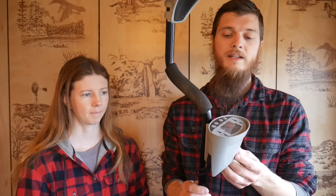We've been using it for a year now and it's been awesome. So our goal is to convert this to run off a Dewalt 20 volt battery. That would give us a longer lasting metal detector and also an easier to charge metal detector, and we won't have to keep buying 9 volt batteries. We always have Dewalt batteries on the charger, so it just makes sense to convert this over. I'm going to start by taking it apart and seeing how it works. It takes two 9 volt batteries, so my guess is that it's running off 18 volts.